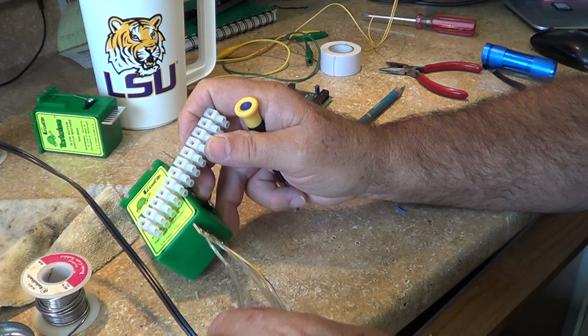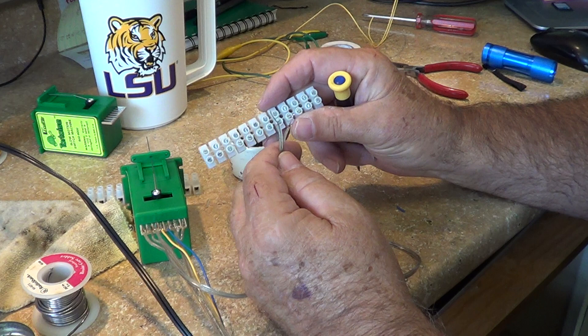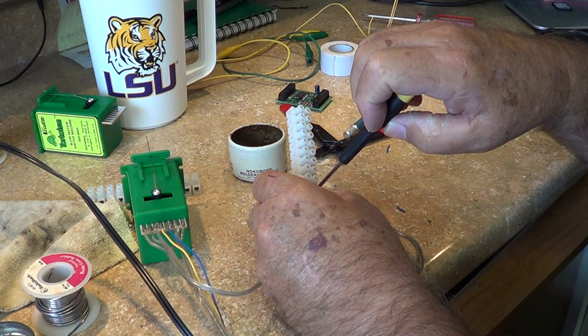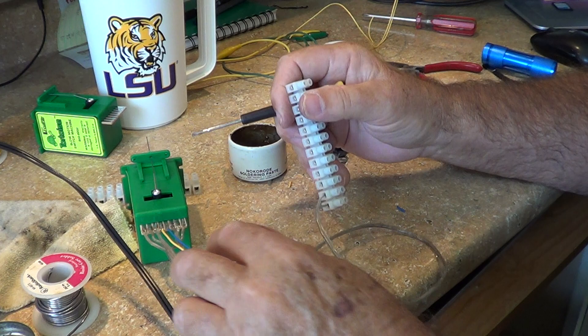What I'm going to do is take this wire for the motor. I mount these so the power feeds go along the bottom from whatever I'm doing, and I put the feeds in from the top. Starting left to right on my railroad, the first two terminals on every machine are the motor. Draw up a diagram, put it in your track wiring book for your layout — that's the way it works.